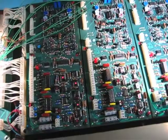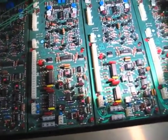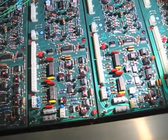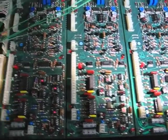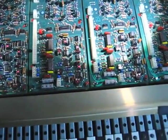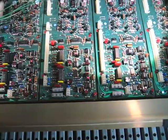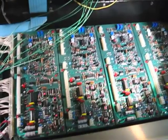So it could go one of two ways: it could be an issue with the autotune circuit itself, or maybe this board is just so far out of tune that it's not possible to tune it. I'm going to bring the lamp around — you can see there's the autotune button there. Press it — it's supposed to tune the synthesizer. And that's what I have to address.